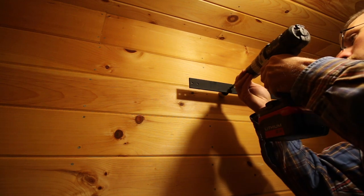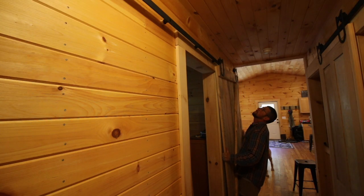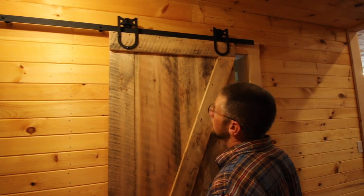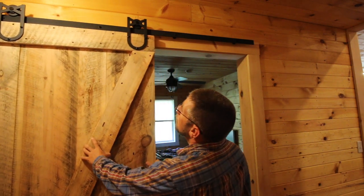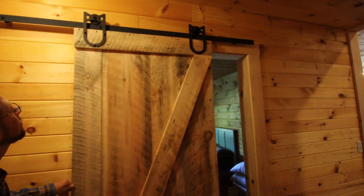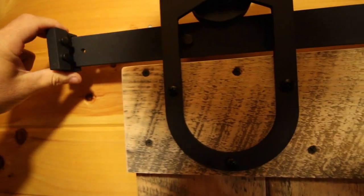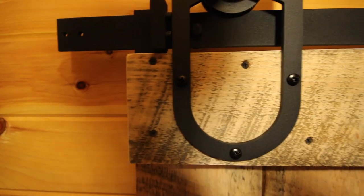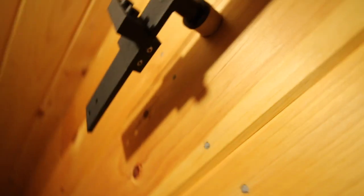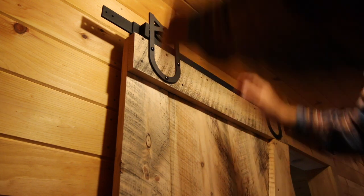It's on — how does it slide? You can't go too far; we don't have the stops up yet. Oh, I like that. We can get the stop to go right there — that'll be nice. These are the stops that come with the door. We need to position them where we want the door to stop. I'm going to slide the door forward because on this side we've got to tighten up the little allen heads from the bottom. That'll hit the stop — boom, it won't go any further. On the other side of the door we've got to do the same thing — that's where I want the door to shut.